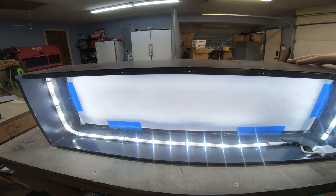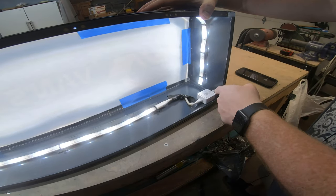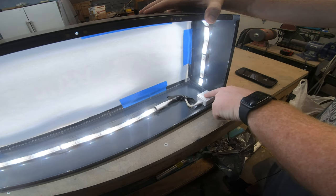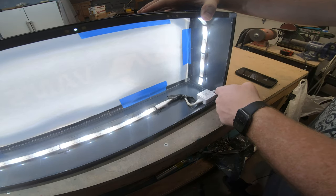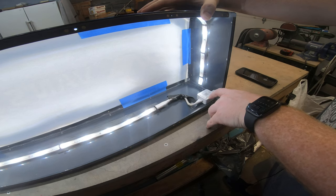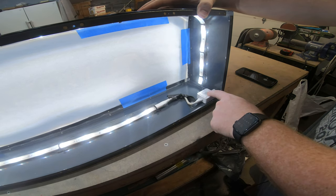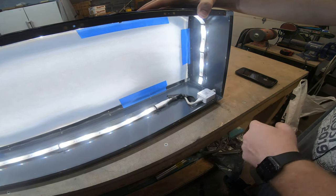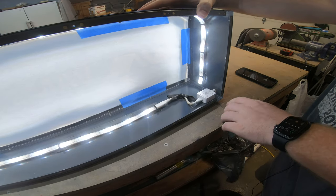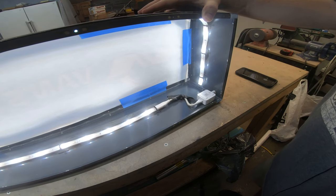On the side hole, I just ran the regular hole that they tell you to run. I didn't end up throwing the grommet in. I just lined this control box up and put an adhesive under it and mounted it to the bottom so that it will feed the cable right through that hole — works out perfect. If you'll notice the box itself is upside down — it's got the adhesive strip on it. The reason I did that is I drilled the hole first and once I realized the height of the box, it was going to throw that off. So I was either going to have to expand the size of the hole, or if I put it upside down, it actually mounted perfectly. It also happens to give me the QR code for the HomeKit if I ever need to add that down the road.